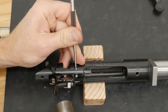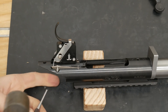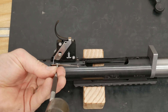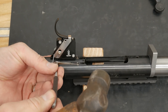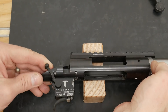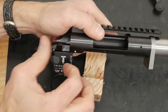Set the center. We want to make sure that we're not against the bolt stop. Then rotate things slightly and very carefully tap this rear pin into place as well. We're almost there, just watching the other side — good and centered now. So now our bolt stop should pivot. Make sure that the safety is out of the way of the pin. Good to go.